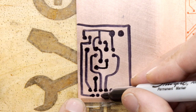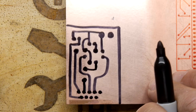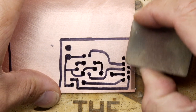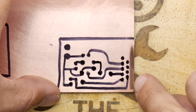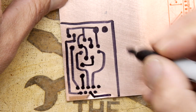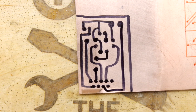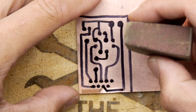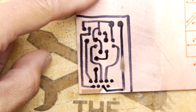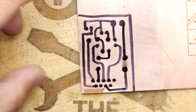There's a bit of sticky residue on the edge of the board that's going to prevent me from doing that nicely, so I'm just going to try to clean that off. I don't mind if the etch resist is on that bit — a bit of copper on the edge doesn't hurt anybody — but when we need it we need that copper. So there is our negative. I've also made a mistake: we do need a resistor, and a good spot would be right here, so I'm going to erase that out and put a nice big circle here. Our resistor can go between those two points.